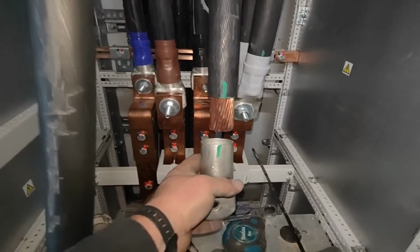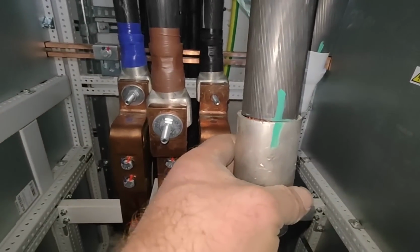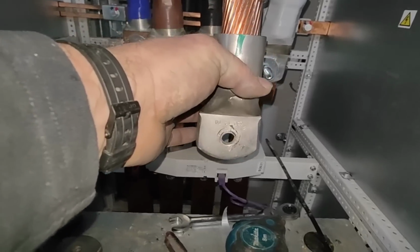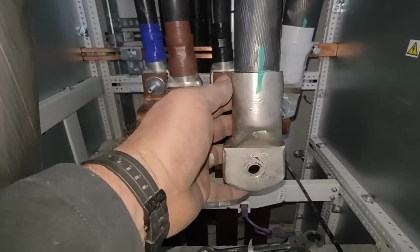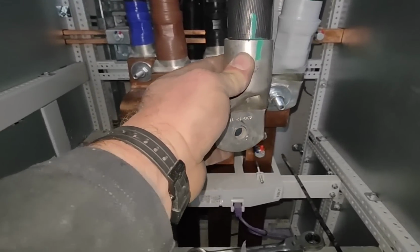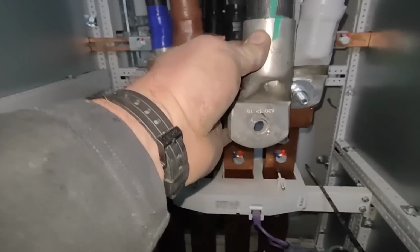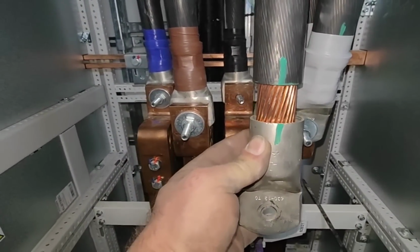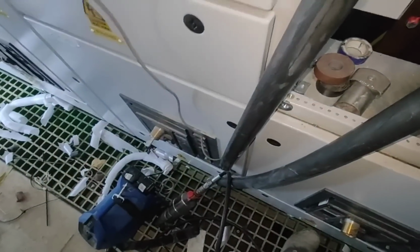So what I've done is you put a mark on the cable and on the lug, and then what that does is when it transfers, see, if you pull off and go, yeah, I've got that, and forget this is here, yeah I know that's straight, but then you put it on and the machine bites it like that, when you push it back, that's 10 mil, even that much, it'll put a bit of stress on the bolt. So if you know the orientation of the lug, you can marry them two lads up when it's in the crimping machine.